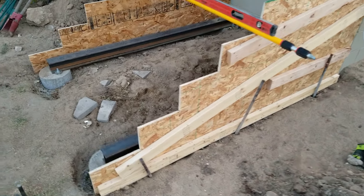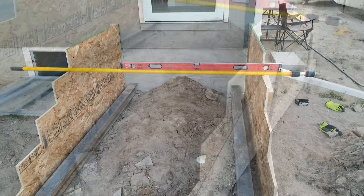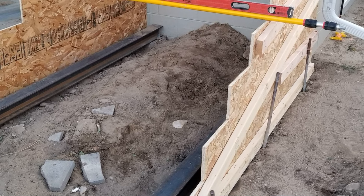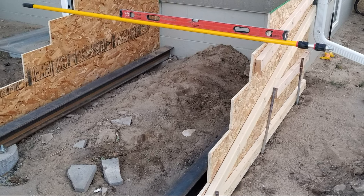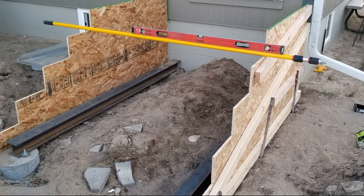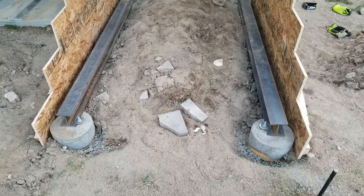Here is the beginning of the concrete form process for my stairs. I used two eight-foot sheets of five-eighths OSB. Alternatively you can use regular plywood, but I chose OSB because it gives the concrete a texture I prefer. I also reinforced the sheets of OSB with numerous 2x4s to stiffen them and keep the sheets from bowing out. To secure these forms to the ground I'm using some three-foot-long rebar stakes, with more supports to be added later. The forms are perfectly level with each other and placed in the exact position I want the stairs. To figure out the proper stair rise height and tread run depth, there are numerous stair calculators online that can do the math for you.